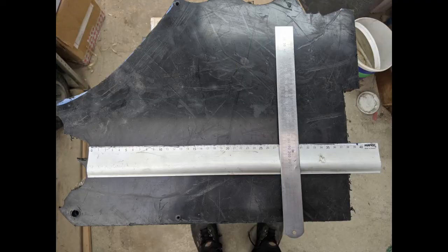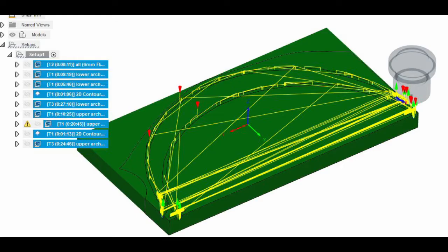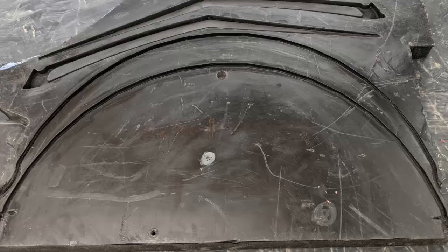Here's the bit of plastic I was going to use for the mould — an offcut from a deadlock robot build. I thought the arches would only just fit on it, so I photo-modelled it up in CAD and used that to position the mould exactly where I needed it in Fusion. Here are the toolpaths in Fusion. Because the arches are quite slender the channel is quite narrow, so it's a lot of machining with a small cutter. Fusion's adaptive clearing technique uses trochoidal milling — lots of fast little nibbles rather than a slow full-width cut. I was really pleased with how the tool came out. I've since learned that HDPE cuts much better with aggressive cuts, as the deep cuts give the best surface finish and fewest burrs.